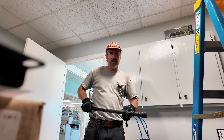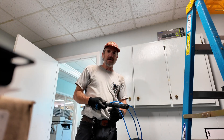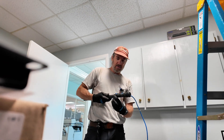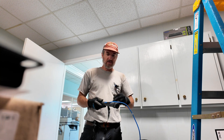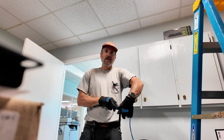Just got the wires out of the ceiling, untaping these. Jordan's in the back going to extend them into the shop. Mount the network cabinet, terminate the data drops, test them, label them. Should be close to wrapping it up.